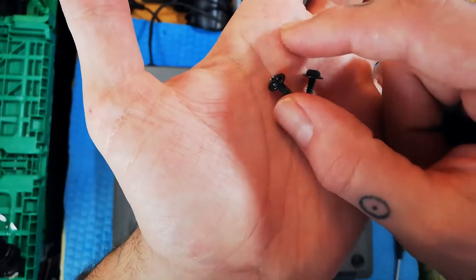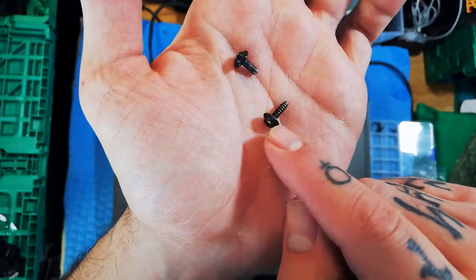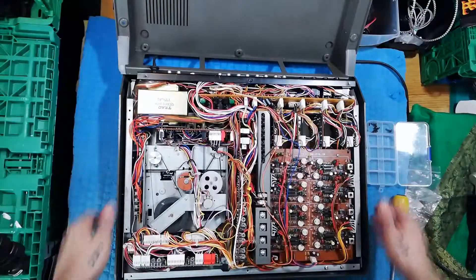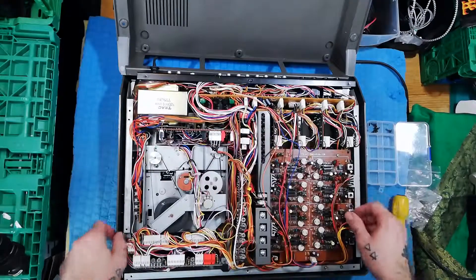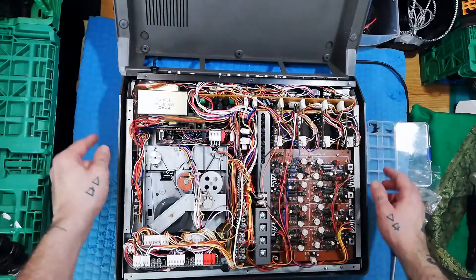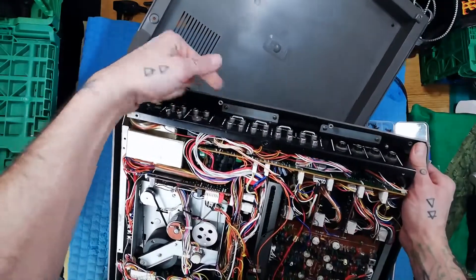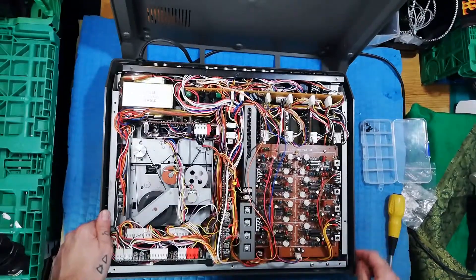There are the two kinds of screw. This one with the wider grooves is going into plastic, and this one goes into metal. If I remove this, you can see that those eight were all going into holes like this in the metal chassis, to which the components and the plastic casing are attached. Whereas there are these little plastic blocks behind the vents where the wider-threaded screws go.